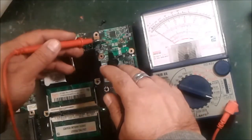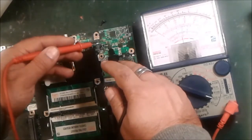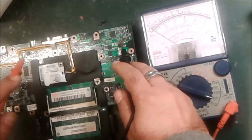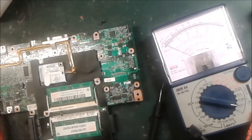You can see it goes to 0 — this means short circuit. Only this part is shorted. If we check here and here — nothing, nothing shows short. You can see it's free. Only this part is showing short. That means this is the short circuit. So this is the part we are going to remove. We switch on our blower and I'll show you how to take it out.